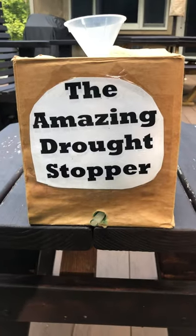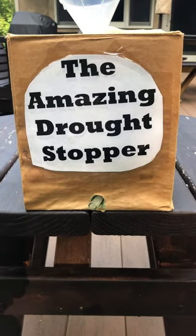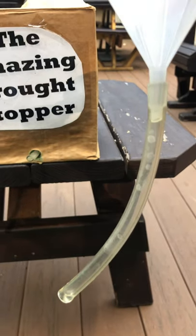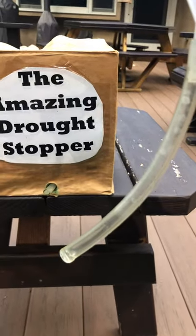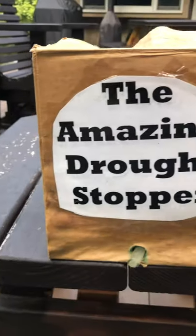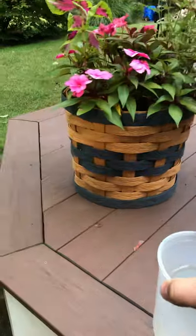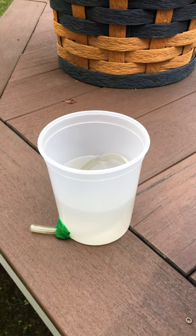I'm going to show you that in a moment. But the big question is: this is a cardboard box. If there was water sitting in a cardboard box, you'd think it would be leaking out. So somehow that water stays in there until I put more water in, and then it all comes out. I'm going to explain what's going on. We're going to deconstruct the black box system, take a look at the parts, and hopefully you'll understand how this drought stopper works. First, I'll pull out the top piece — all we have here is a funnel connected to a piece of PVC piping. The only purpose it serves is to funnel water through the piping into the box.